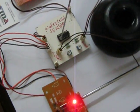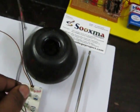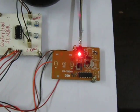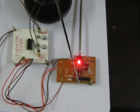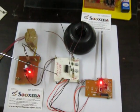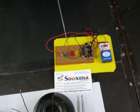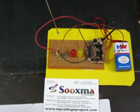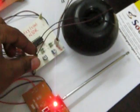This portion is to check the low level water and this portion is to check the high level water. This is our RF transmitter section — this is our encoder IC, which will encode the message received from this particular IC, and through the antenna this will send the message to our receiver section. This LED will glow according to the water level.